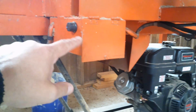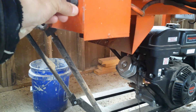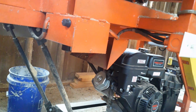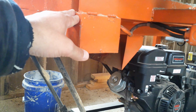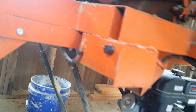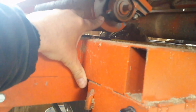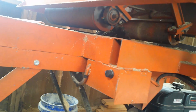This box right here has a rheostat in it. This adjusts the speed of your feed rollers — faster or slower. So in the event you're cutting some really hard material, you can adjust this feed rate down so the wood passes through the blade a lot slower. You've got the feed rollers right here as well. This is a pressure roller up here, and down here is the actual feed roller that drives on the outbound side of the edger.